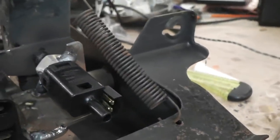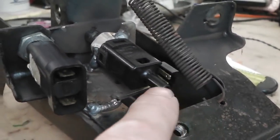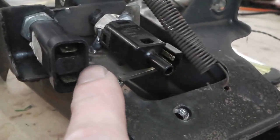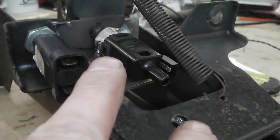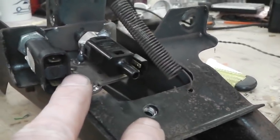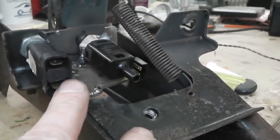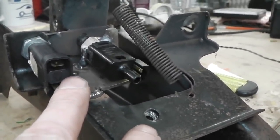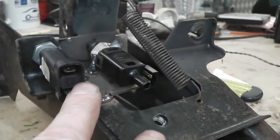It's also the electrical switch as well, which breaks the cruise out. The cruise actually activates off both of these, or deactivates off both of these. It can pick up a loading on the lamps, and it also checks that your light bulbs are present. I've mentioned this before. Cruise won't work if you haven't got your filament bulbs connected, or a loading equivalent to that. If you change your lamps on a car with cruise control to LEDs, you may well find your cruise doesn't work, because it looks for a resistance path through to ground via the filament of the bulb.